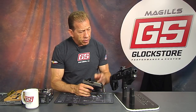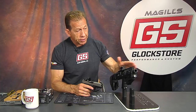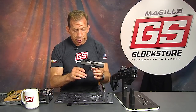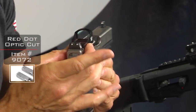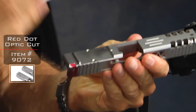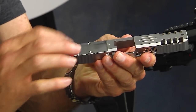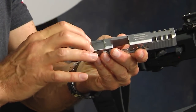What I want to do today is talk about the red dot mounting concept, actually mount it on here, and then go shoot it. We'll talk about how to shoot this from a shoulder-fired situation. I've already shown you that we mount red dot optics here at our shop — we do what we call our red dot cuts, and it is based upon the particular red dot sight you're going to use. We've got a machine shop and people send their slides in; we cut it out and mount the red dot optic using two tapped holes.